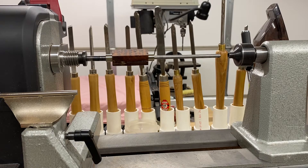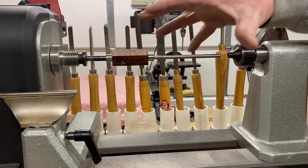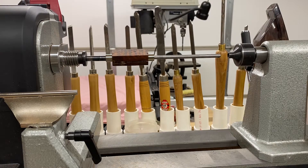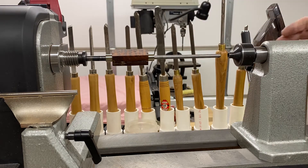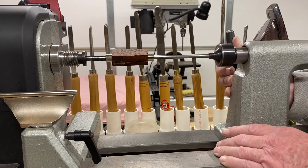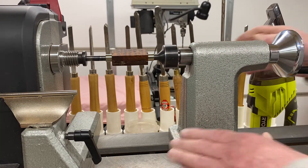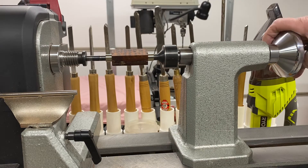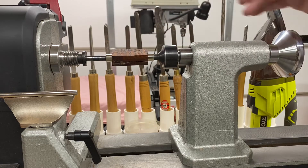What I've got here is the tailstock. This here is a pass-through, so no matter how tight I put pressure on the tailstock, it'll never bend the mandrel shaft. If I've done it right, this aligns up, slides right in, puts right up against that, I can lock it down, and then I can adjust my pressure with the handle. That way I can make sure this isn't spinning.